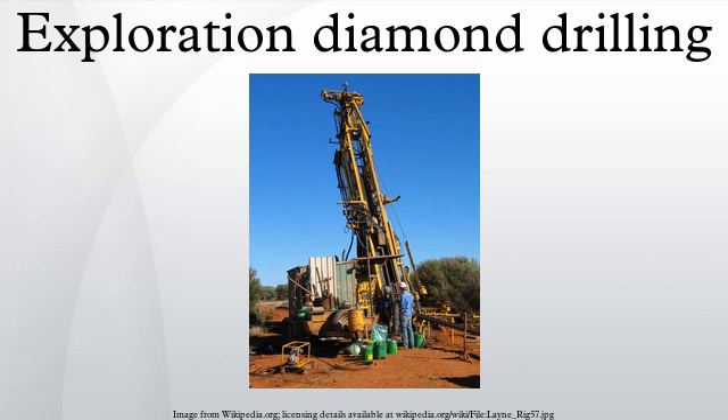As shown in the figure, the diamonds are scattered throughout the matrix, and the action relies on the matrix to slowly wear during the drilling so as to expose more diamonds. The bit is mounted onto a drill stem, which is connected to a rotary drill.